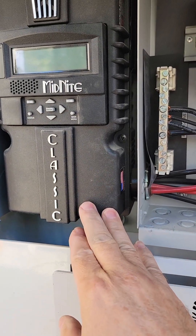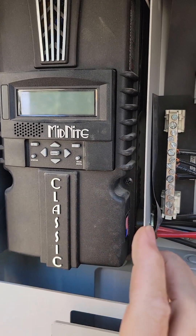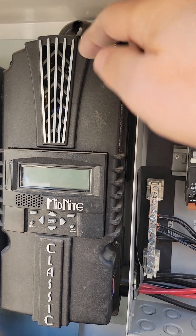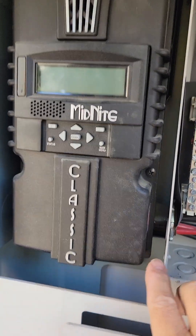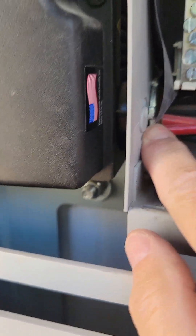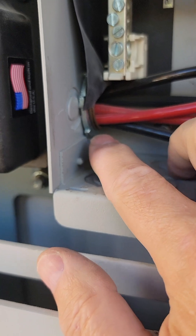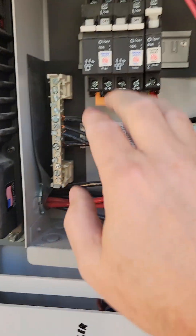I've never really had a loose wire inside the midnight charge controller itself. You'll see there are four screws — one, two, three, and four. Take those four off and the front panel comes off. Behind that there are two bolts at the bottom and one at the top — those three bolts are what hold the midnight charge controller on. It's a hassle to take apart because the back of the box hits these components, making it difficult to tighten or loosen. Just know it's a real hassle if you get in here.